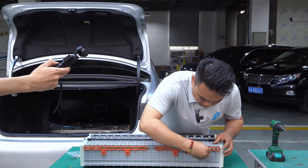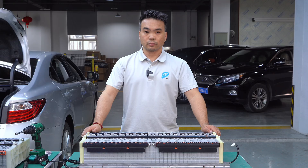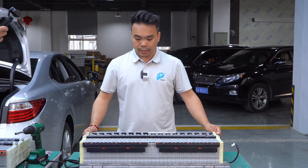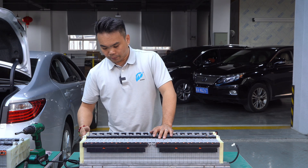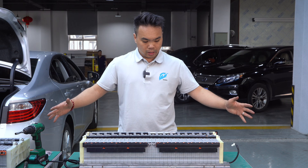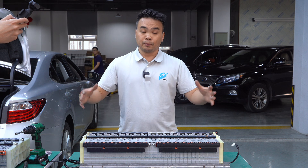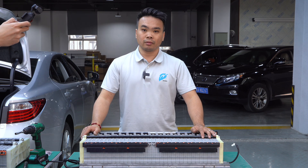This step is going to be tedious and takes a long time, so we're going to fast forward it and just install everything. After installing the bus bars and replacing the battery modules, this is what it looks like — the new pack with the old brackets. Now just reverse the installation: install the sensor, the brackets, the casing, the BMS module, the relay box, reassemble everything, scan the vehicle for faults, roll test the car, and you're all set. Thanks for watching.